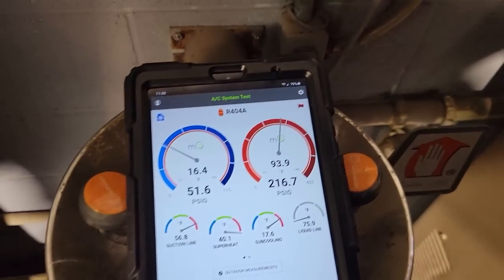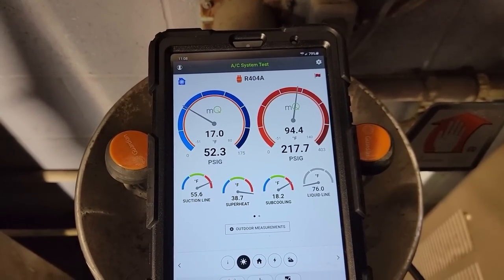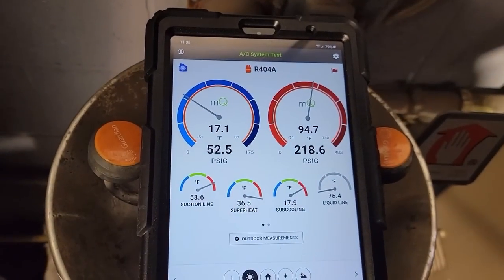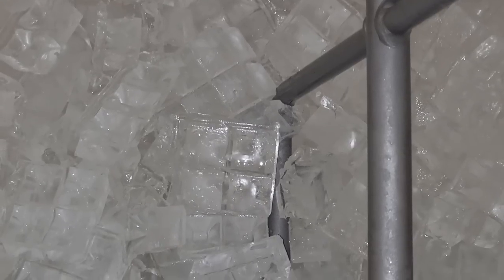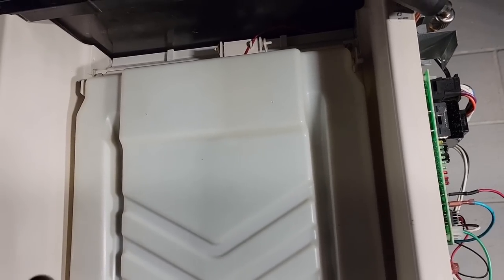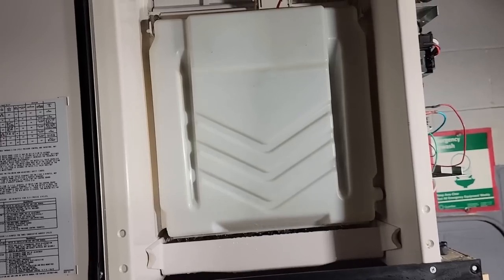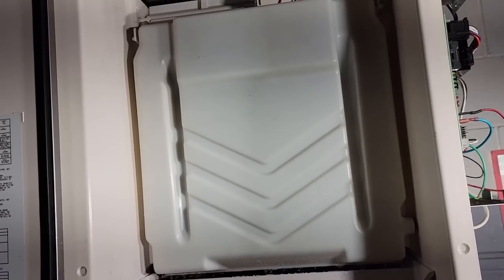Usually that high-pressure switch comes on around 230 to 235, which it's running right now and cooling down to about 90. So it might be a little out of whack — we'll watch that a little bit. It does appear that we're getting in the right area. Usually when you start hearing a crackle of the plate, you're going just a touch too far. What that's doing is expanding to the point where it starts shifting your nickel-coated evaporator, and you can crack it loose. Next thing you know, you've got the slats falling out and you've ruined your evaporator — I really don't like hearing that.